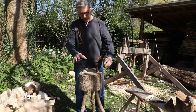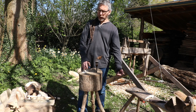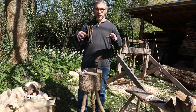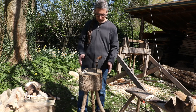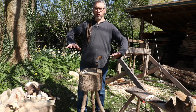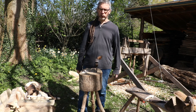Most important thing — or the two most important things — this is the first one: the chopping block. A simple piece of wood. This one has got three branches with holes drilled into the bottom of the log at a nice angle so it's relatively stable. You do want a stable base to do the axe work on — you don't want something that's rocking around all the time. A nice wide angle on the legs. If you've got a big lump of wood that's the correct height, that's fine. But if you've only got short pieces of wood, just make yourself three legs, drill some holes and you've got your chopping block.